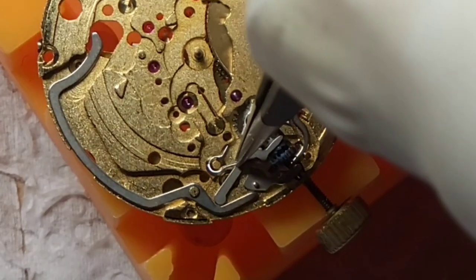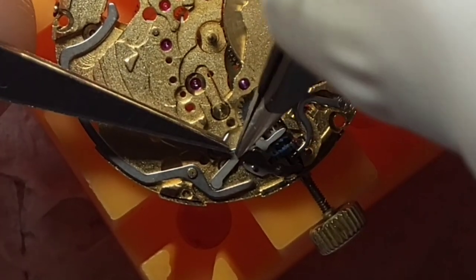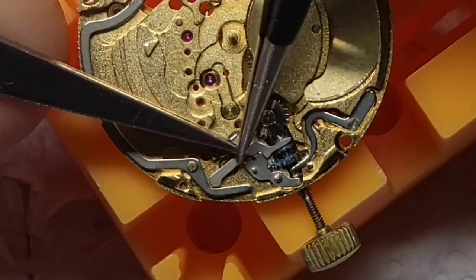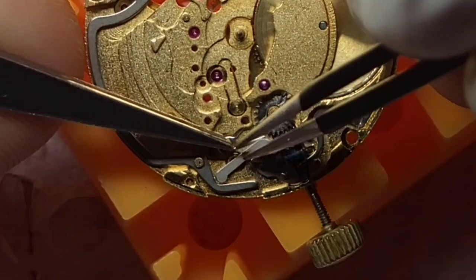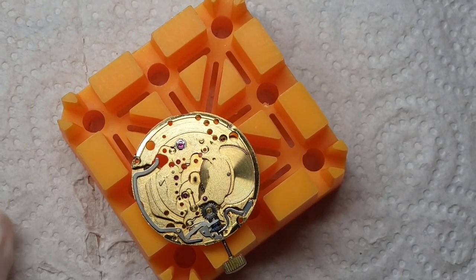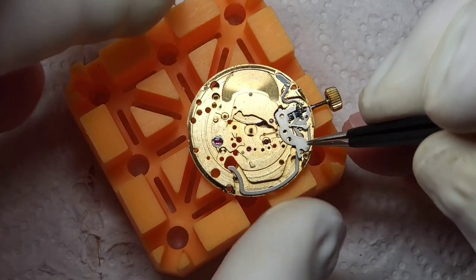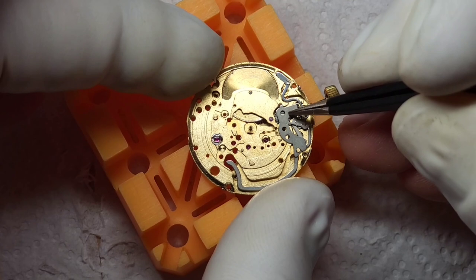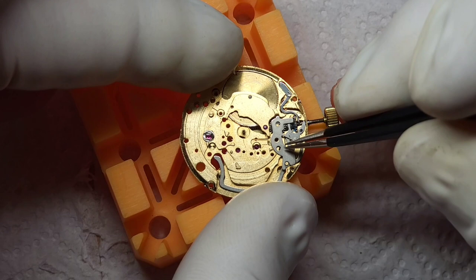I found the best way to do it is get one end in, then just pull it over and eventually it should fall in. Now it's on — I'm just going to give it a good push and then act as if I'm disposing a bomb when I put this second plate on with its click, because that is going to cover over that yoke spring and make sure it doesn't fly out. One thing which plagued me is a comment from my previous video — that I was using screwdrivers which had become magnetic. They were not sold as magnetic screwdrivers, but screwdrivers seem to be able to gain magnetism. What I need to buy is a degauss block — it's what you can buy to make screwdrivers magnetic but it's also got a portion to remove the magnetism, which is very useful.